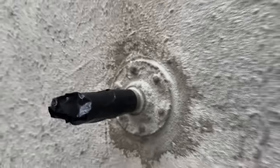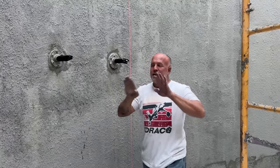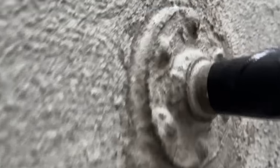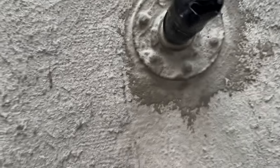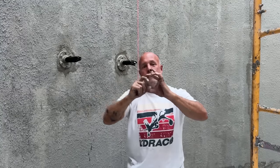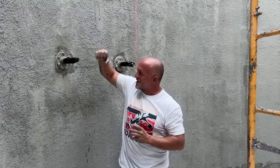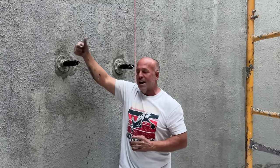The way I made these plates work, because the pool currently, until we smooth it out and make it perfectly round, has the bends in it from the 2-foot panels that made the concrete forms. And so what I did is I made giant stainless plates with a hole in the middle. Then we machined these brackets to go into that hole and have a big wide flange. And then I could slide this in and pivot it right, left, up, down.